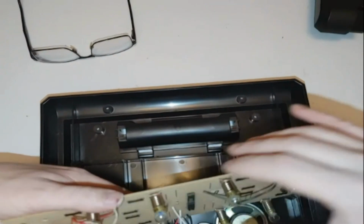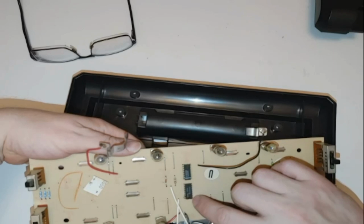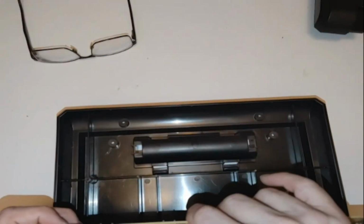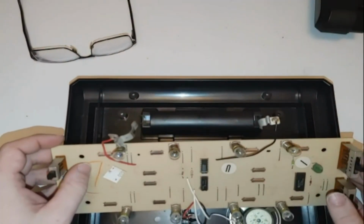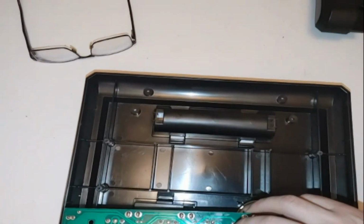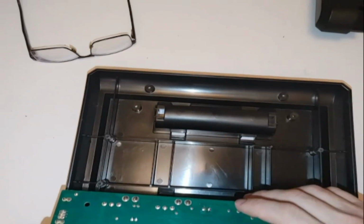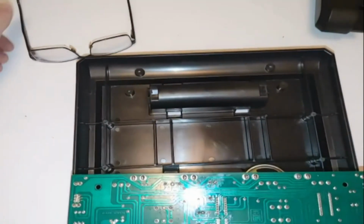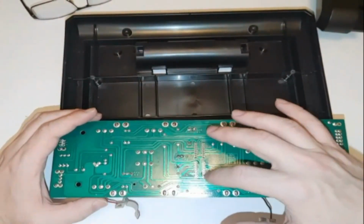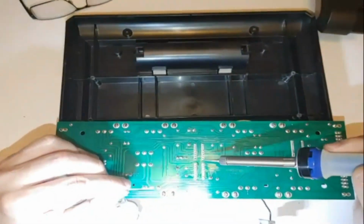Alright, nice tight fit in there. So this is pin 1 facing down here, same as down here, pin 1. Let me just double check on the board here. So the chip is in the right way. Double check one more time. Pin 1, that's pin 1, that's ground, that's ground. Yep, so we are good. So it is in correctly. Sorry if that was off camera, guys, but I had to just kind of check to see. Okay, oh, I hit the camera again. Sorry, guys.